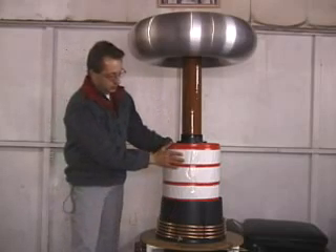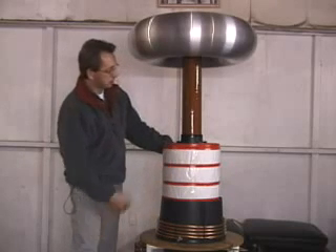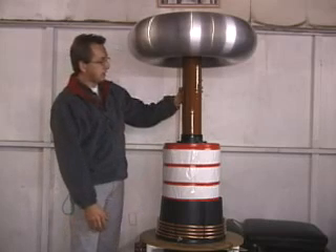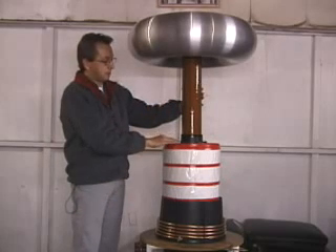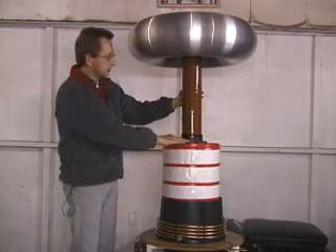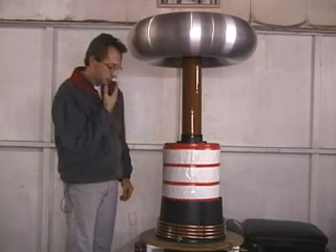The way I did that was to put the driver into the secondary section, put the primary into the primary section, and put the extra coil as a top load object. Obviously it's a cylinder, so I modeled it as a cylinder, and gave it a top load connection — since it's connected to the top of the driver coil. And of course I put the toroid in its appropriate place among the top load objects.